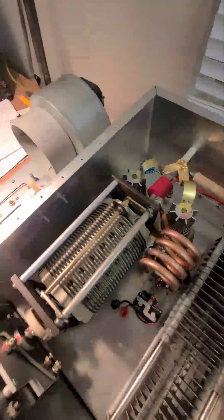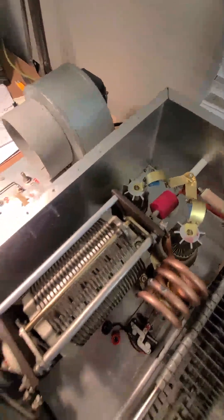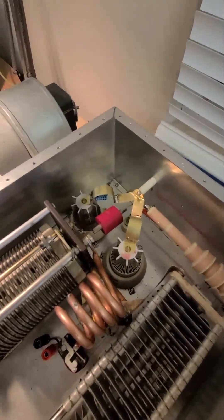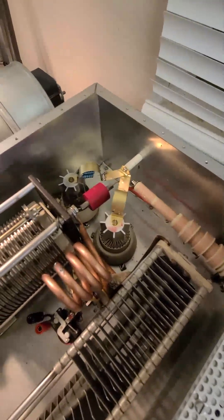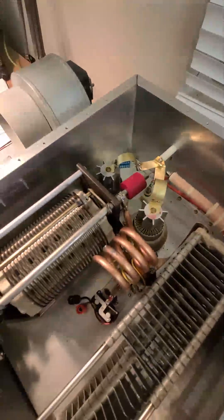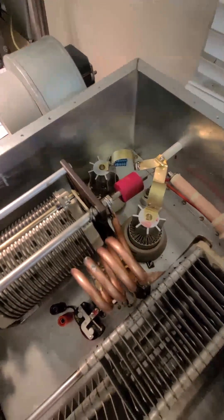We went to what I saw in one or two amps, and I heard a couple of guys saying they had good luck with this method: instead of a coil, using brass — or actually stainless steel, even better, something with a little higher resistance — and forming a large half-turn loop with the brass. I punched holes in the sides and put in a pair of 2 watt 100 ohm resistors.